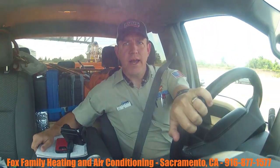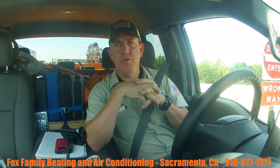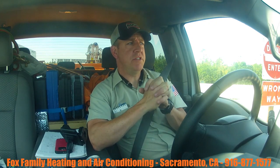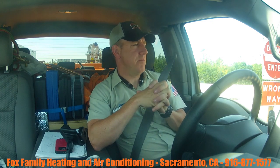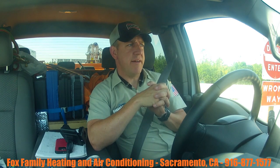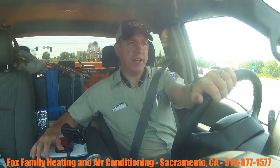The guys at the Lime Cove Court install I showed a couple months ago are finally finishing up that house, so I get to go back and do startup. It was a two-heat, two-cool Bryant system with zoning and Honeywell 9000 Wi-Fi thermostats. I just need to go fire it up, set the stats up — he doesn't have his Wi-Fi in yet but I'll come back for that. It's a big job and I hate having a system out there that's not up and running.